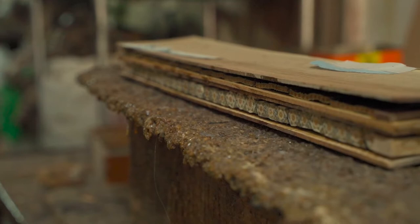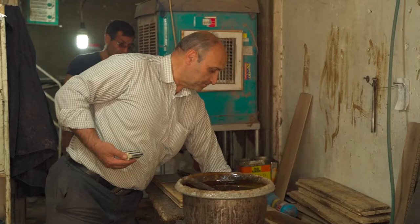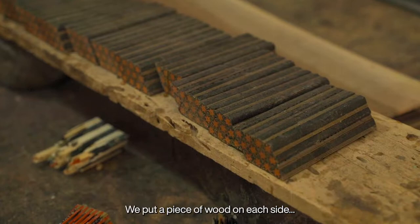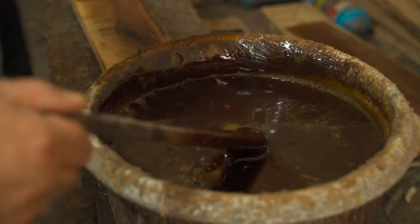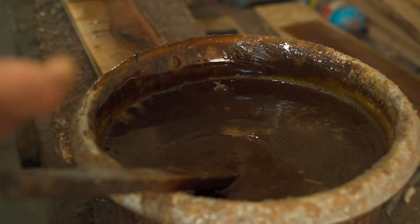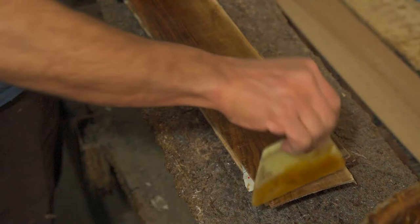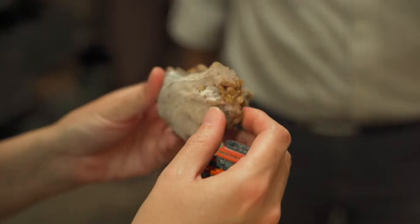So, after the khatam flowers are made, they should be put together to form a bigger pattern. The pieces are put next to one another and they are sandwiched between two pieces of flat wood. They also apply a very traditional substance called sereshum that acts as glue, sticking everything together. Sereshum is a sticky substance made from the fat and gelatinous parts of animal bones and intestines. It is only made in the city of Yazd in Iran, and it is made into rock shapes like this.